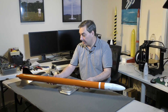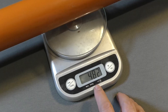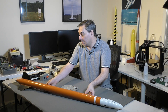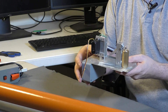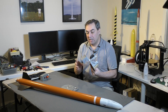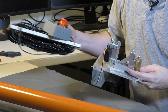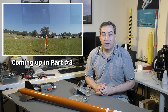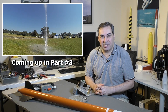So that's the rocket finished along with the deployment mechanism. Before we launch it we want to weigh it so we can run our simulations — it's 482 grams, which is really light. We're really happy with that. To launch it we're using one of our older cluster launcher release heads. We modified the nozzle seat for the seven millimeter nozzle that this rocket uses and we've also added a control box that's remotely triggered with our remote trigger. But to see that launch you'll have to wait for the next video, which will be coming up soon. Thanks for watching and we'll see you next time.